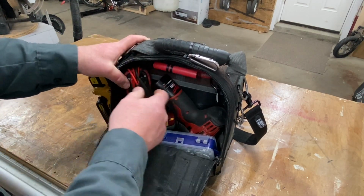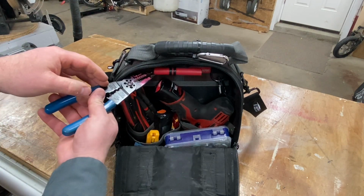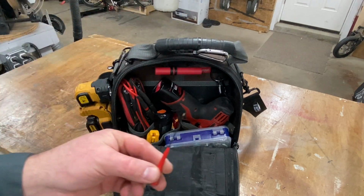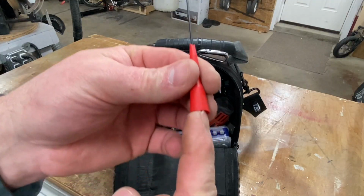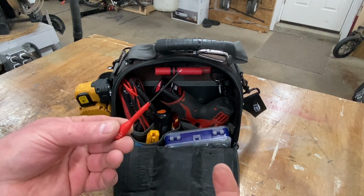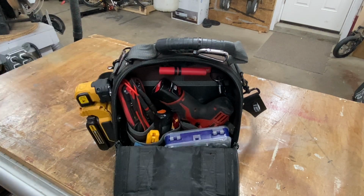So, these are those back probe sets. Here, I'm gonna grab a pair of pliers here. I don't use these a lot. The Trane Hyperion air handlers, things like that, have very, very small test ends. You gotta use the tiny little back probes. So those go right on the Fluke leads. And they're super sharp. And they're kind of delicate. So the two of them fit real nice in this little piece of PEX. And it keeps me from getting jabbed. And it keeps them intact and works real well. So that's it on that side.